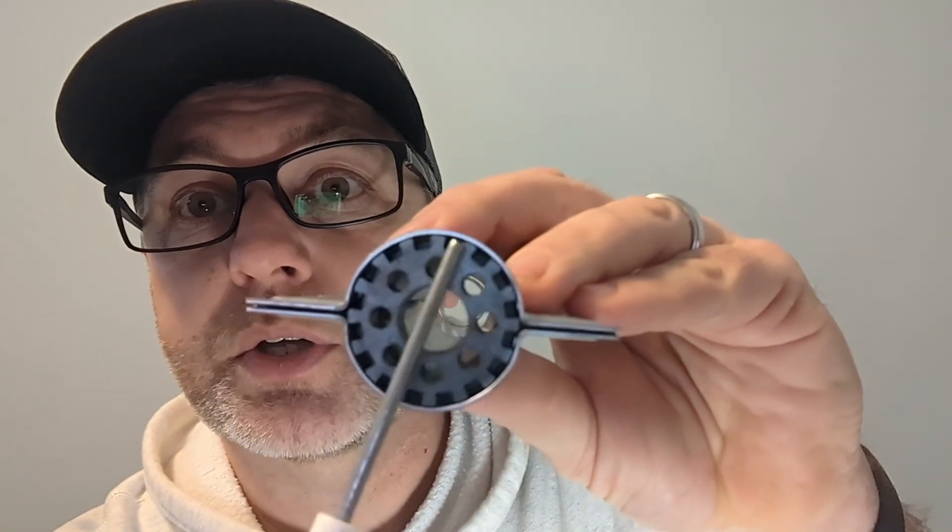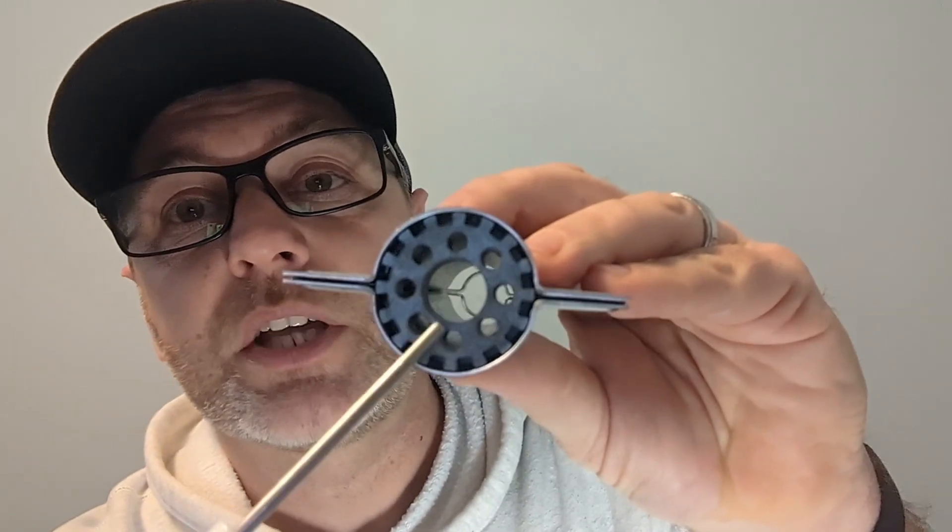So you have an air-gas mixture inside the burner and then it comes out the face. Now due to some of the chemicals or minerals - the makeup of gas itself, be it natural gas or propane - whatever is in there will actually cause that burner to start deteriorating a little bit, and we start getting a little bit of rust. See all those little holes in there - if they start plugging up, that gas does not come out the same way. When that flame comes out of that burner, it comes out and narrows down, almost looks like the exhaust of a jet flying through the air.